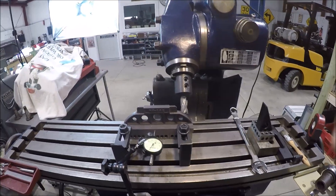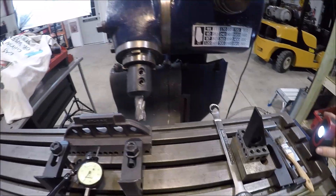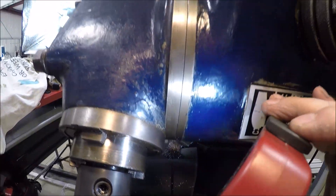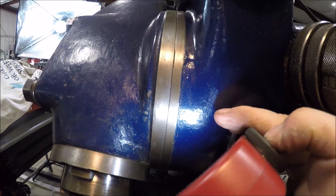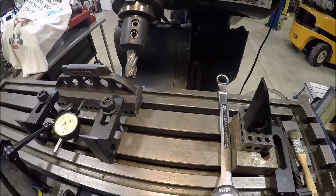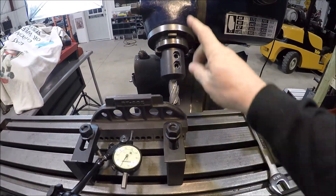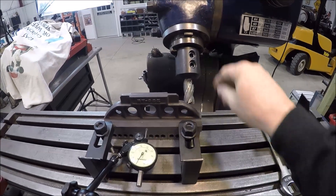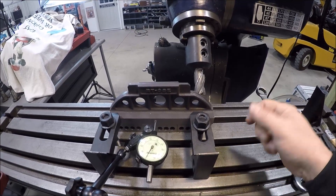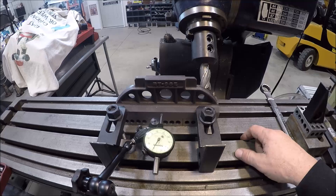Here's the setup. I've got the head turned to 45 degrees — I don't know if you can see that or not. Right there. So I just use the graduations there. It's not super critical, pretty close. I'm not going to use a sine bar and a stack of gauge blocks to verify it. I mean, if we're off just a smidgen, that error will get taken out once we get over to the surface grinder because this will be sitting on V-blocks.